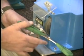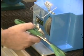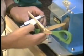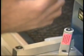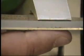Once the corrugating is done, shut your machine off in the back and lift your shear out of the arm. Then we want to check and make sure that we have a good corrugated edge. Let's see if we can get that shown in the video. And there it is. You can actually see each of the teeth that were created across the length of the blade. Let's pan the length of that blade just a little.